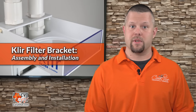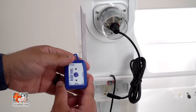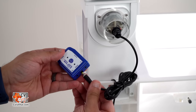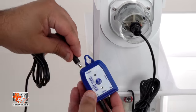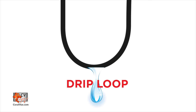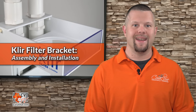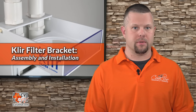The final step is to install the clear filter controller. Attach the motor to the motor input of the controller and the sensor to the TS input. Finally, attach the power supply to the controller and connect it to the power outlet. Be sure to hang the controller in a dry area away from water. A drip loop should be arranged for each of the cords connected to the controller to prevent water from traveling along the cord and coming into contact with the controller or electrical receptacles.